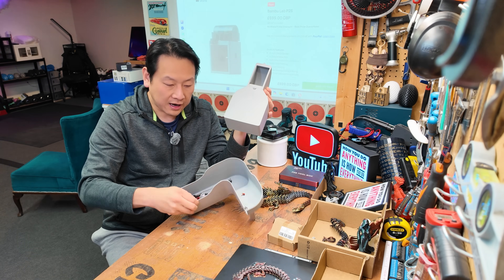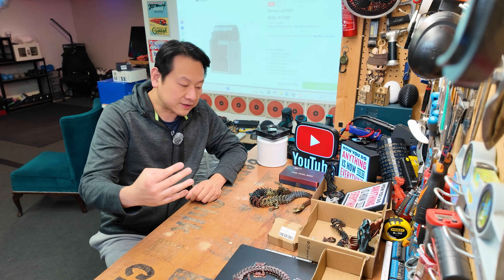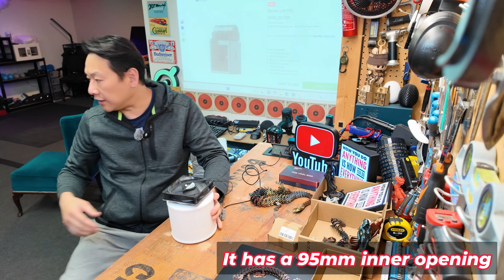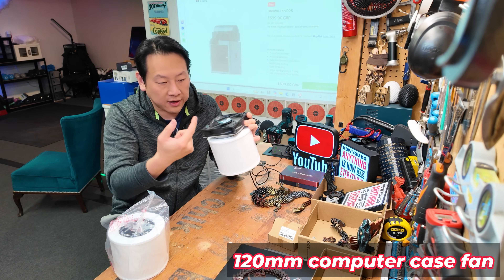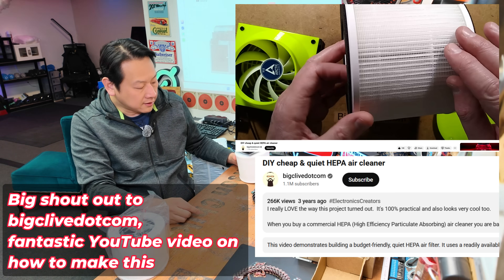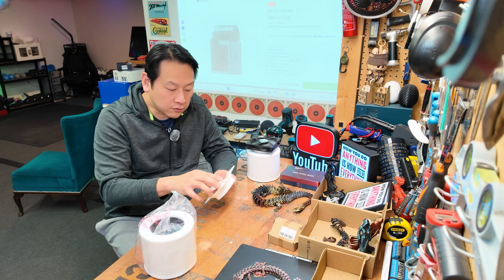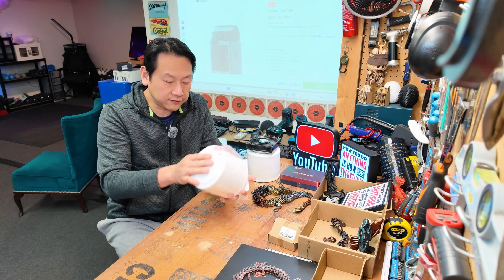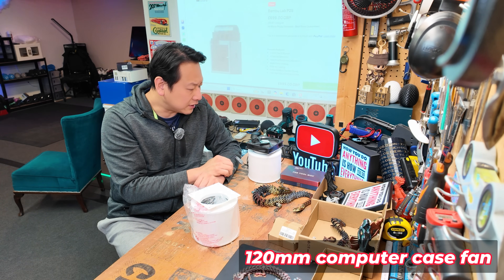I won't visually see how much material has accumulated in there, but that's a minor thing. I'm also going to print an exhaust that points to one side and use a little filter. This is a DIY air filter — a 12-volt computer fan, about 14 centimeters, with a printed adapter. The air comes out from the top, drawing all the air in from outside, with a blanking plate on the bottom — this becomes my air filter. I'm going to have one behind the machine and maybe one near me to see if I can get rid of the smell. There are a lot of tutorials on how to make this kind of filter, and I'll put the link in the description.